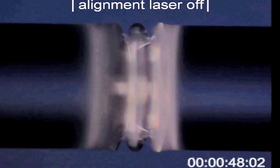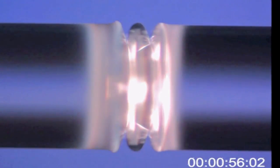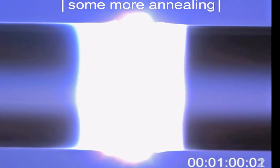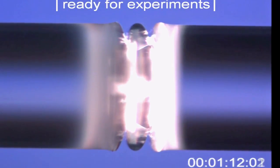The result is very high quality factor micro cavities that we can create in under one minute. One of the unique aspects of our fabrication technique is the control of the resonator size. For our work at NIST, this means that we can make frequency combs with a very wide range of spacings — something that's not possible with traditional comb technology.